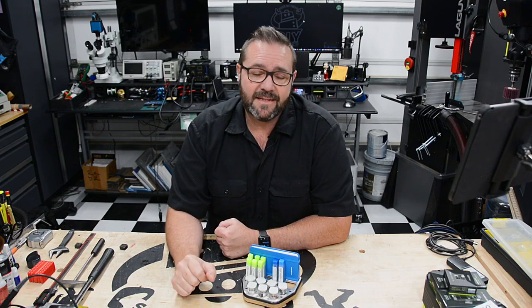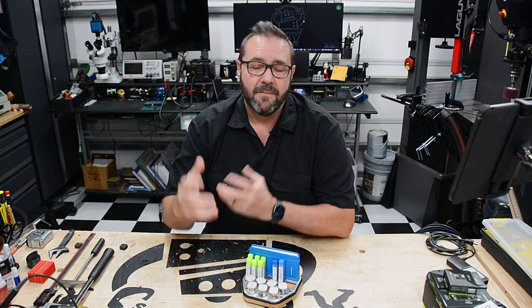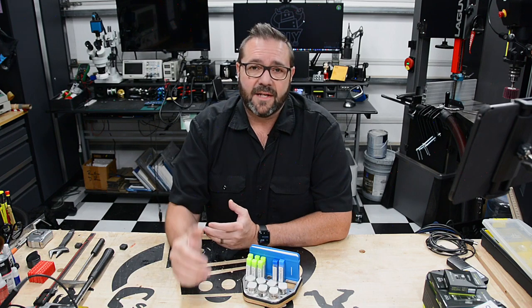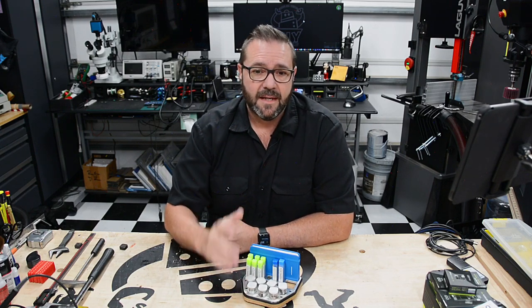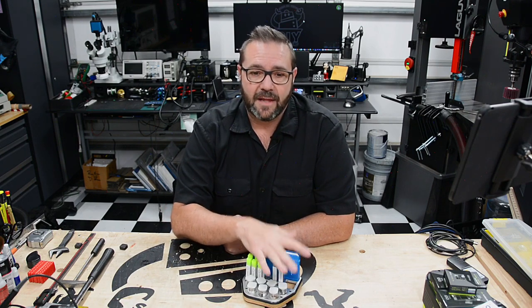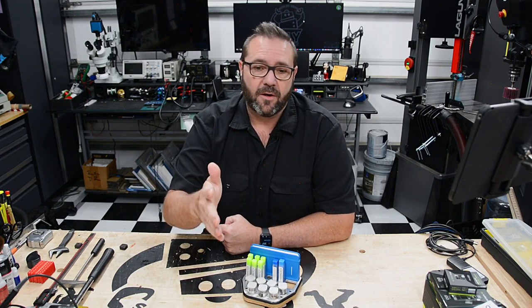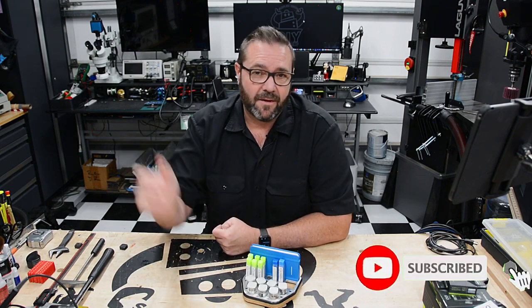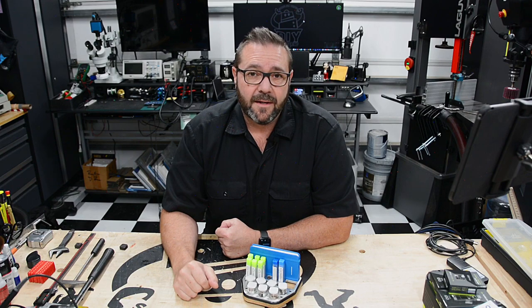I've listed it as my favorite machine, and this is raising the bar beyond that. It's added 20 pounds of weight just in the body and structure of the machine, making it more rigid with less mechanical resonance when milling hard materials like aluminum. It also demonstrated that its capabilities far exceed this little project. Over the next few videos we'll be throwing more difficult challenges at it to see just how far we can push this little 500 watt brushless spindle and the structure of the machine. If you're new here, hit that subscribe button and ring that notification bell. If you liked this video, give it a thumbs up. Be safe, have fun, and I'll see you next time.